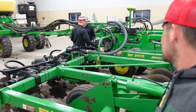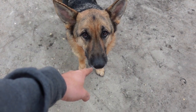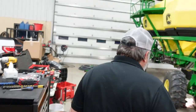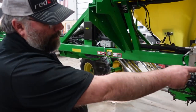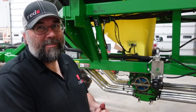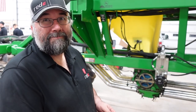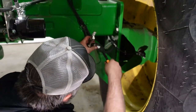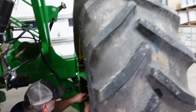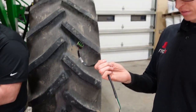Right now if you climb in your tractor it says the back meter is spinning at 42 RPM — and it's not; I'm looking at it and it's not. I had that sensor on the front tank and it said it was spinning at 50 RPM. So it's the sensor. Luckily we've been storing an extra sensor — that's actually the reason I switched over to the hydraulic drive, so we'd have an extra sensor. Same part number. Which one's the bad one? That one there.